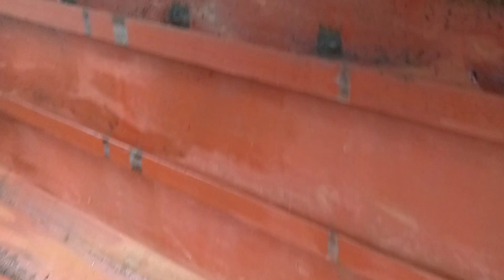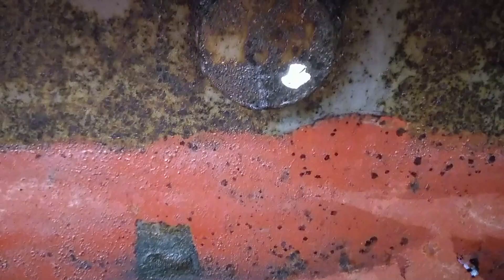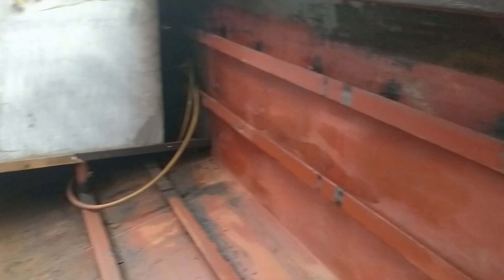As I said, there are odd little repairs which look quite dramatic. That's one of the tie-down rings from outside that has obviously rusted through, so that needs just a little plate sticking over it. And again, down the gunnels, you can perhaps see there are various screws and bits and bobs that are going to need grinding off.